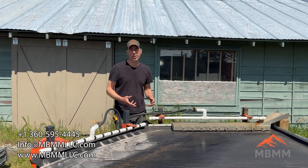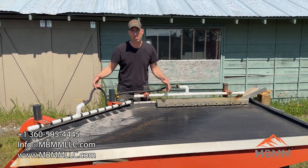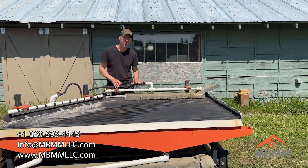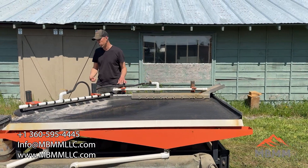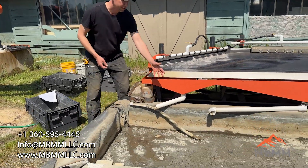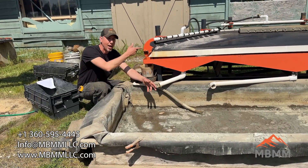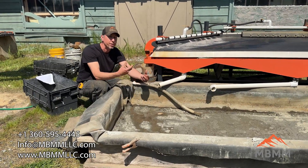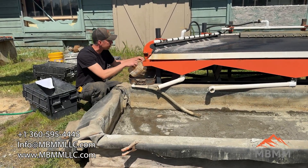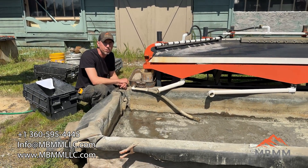This machine is really simple to operate and set up. It's sitting just in the gravel here — it's weighted down a bit so it doesn't need a concrete pad to bolt down to. It uses about seven to ten U.S. gallons per minute, and we recirculate the water over and over again once it gets down into this catch basin. All the tailings — the number four and number three plastic and light stuff — come down into the tailings pond, and we recirculate that water so nothing gets discharged into the environment. The number one and number two valuable metals come out in these little buckets that we can send back to the customer to analyze their sample. Let's get this thing fired up and see what we can find.